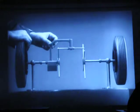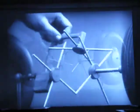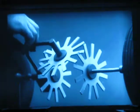In order to reduce the jerky action caused by wide spaces between the spokes, we will put in more spokes. Further filling in the spaces between the spokes gives steadier, more continuous action, and changing the shape gives firm, constant contact. Now we can make the gears thicker and stronger, and we have differential gears. The edges are cut so that they will fit together more smoothly and silently. And another gear is added to share the work of driving the axles. The principle is the same.